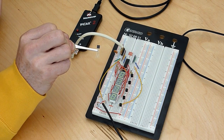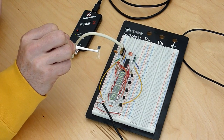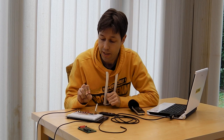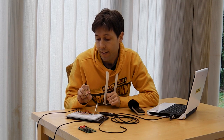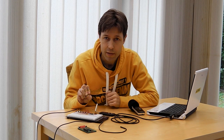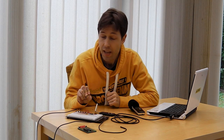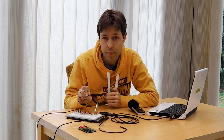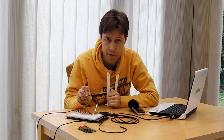You can decide to connect all three pins, and that way you provide it constant power. You can also decide to use two wires, and in that way you run the component in parasite mode — the temperature sensor will actually steal some current off of the bus. If you use two wires, you will need to do a little bit more coding because you need to actively provide it with power during the temperature conversion cycle.